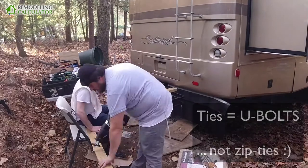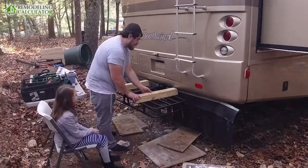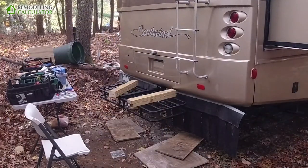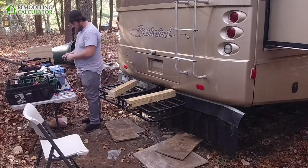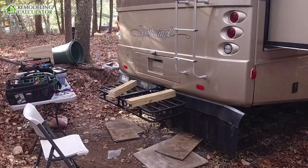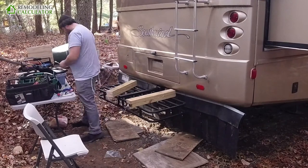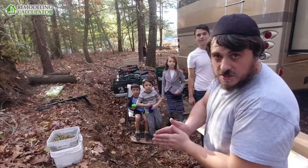Here, me and my daughter were cutting pressure-treated 2x4s that will create a nailing surface for the condenser unit, and also they will add space underneath the condenser for any potential ice buildup, which could cause problems during heating cycles. That additional four inches will make sure there is minimal ice buildup. This condenser unit has a heating strip on the bottom, so any ice buildup inside during a defrost cycle will melt and could accumulate underneath — that's why I'm adding four inches of support, and later I'll use U-bolts to attach those 2x4 standoffs to the cargo rack.